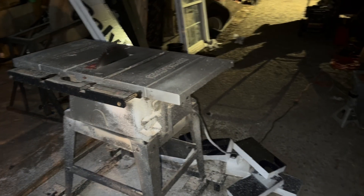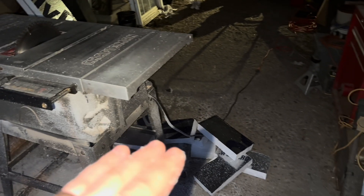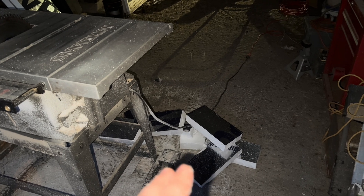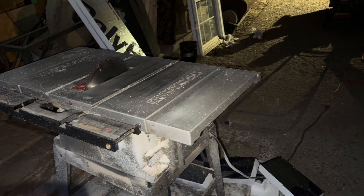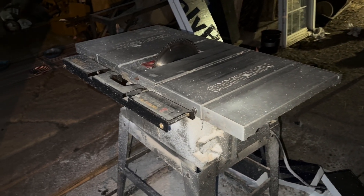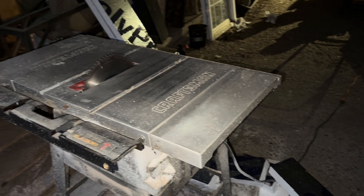I think all this will really help with sealing off some of this basement. We're getting a lot of heat in the summer and a lot of cool air in the winter coming up through and rising through our old home. The foam board cuts nicely on the table saw. Cut the four-by-eight in half and then attack each of the columns or rows. You want to cut each one about halfway, spin it around, cut it again — don't cut it all the way through so it flies off while the blade is spinning. Cut it really close, then take it off and snap it. That's the easiest, safest way. Make sure to wear gloves, eye protection — this stuff gets everywhere — maybe even some really ugly clothes.